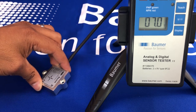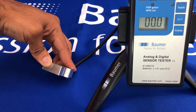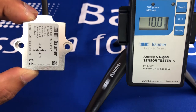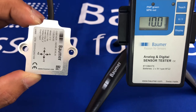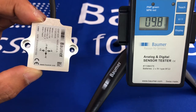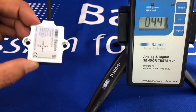So from 10 volts at 45 degrees, back to the mid flat point at 5 volts, and lifting the front end to our 0 volts. This version can do two planes simultaneously with two separate analog outputs. This version is 0 to 10 volts on both outputs, but you can also get 4 to 20 milliamp. The resolution in both directions is 0.05 degrees and the accuracy at 25 degrees Celsius is plus or minus 0.4 degrees in both ranges.